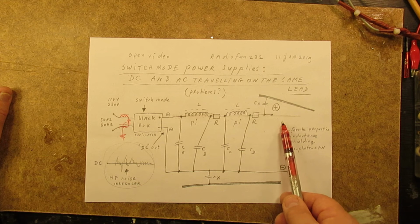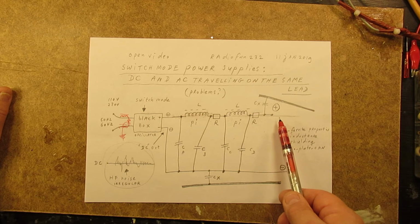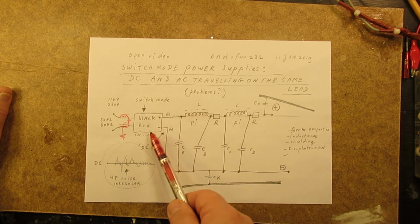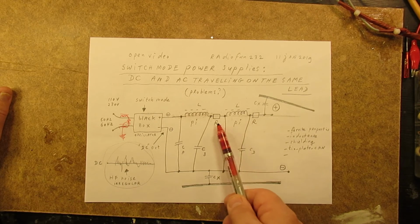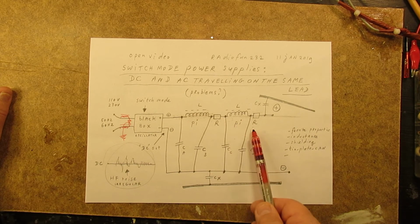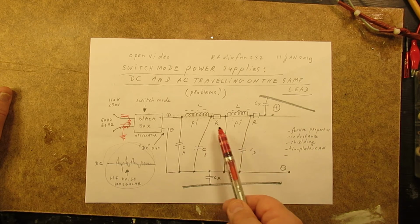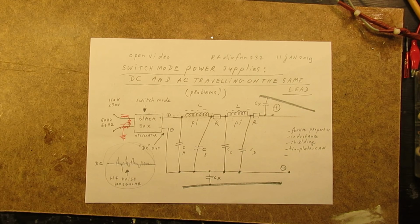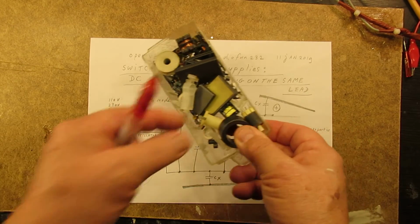It could be, when you have an audio preamp that takes 3 milliampere or 10 milliampere, that this works. Then you can make the value of these resistors higher. That gives a better smoothing effect. You can also experiment with different ferrite materials for the filters.